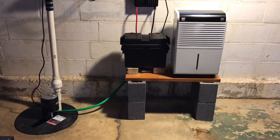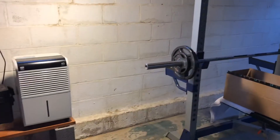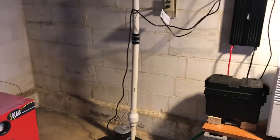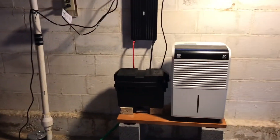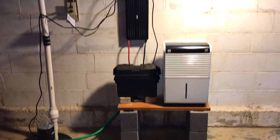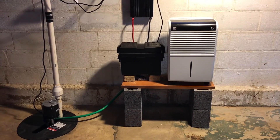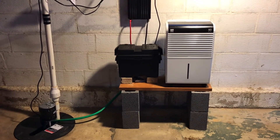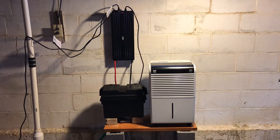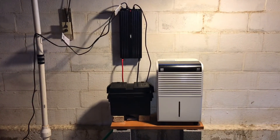In the event of a power outage where the sump begins to take on water — we do get weeping here in the basement, very little accumulates — what happened this spring was the sump actually filled with water due to saturation in the yard out front. So the next step is to install some water sensors on the floor that will alert us, and I also need to put a UPS on our Wi-Fi source on the first floor so that our water sensors can alert us when water is beginning to collect.